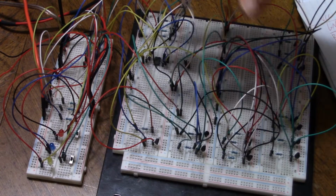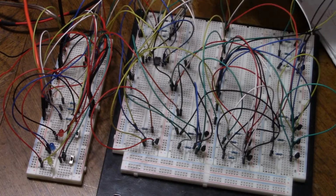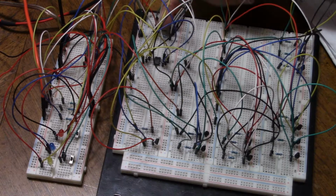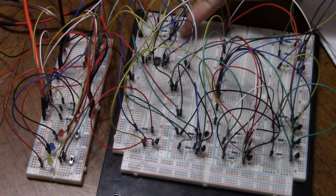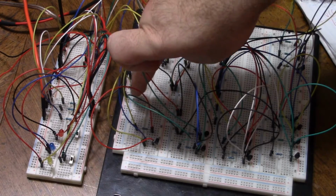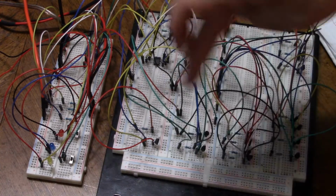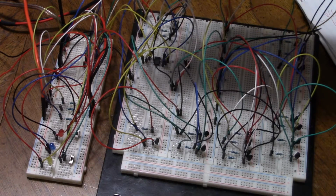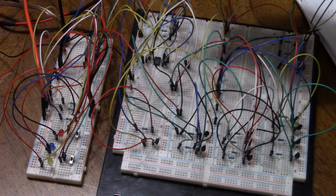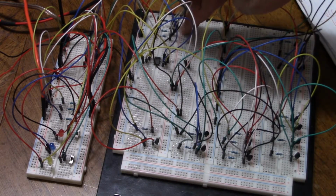Then over here is the actual chip. So VCC and ground come in the corner, and I've got the voltage divider, 3 resistors forming the voltage divider here, and cont is connected to the first one. The 2 of them give the high and low ref, which I have brought over here for organization. This is how I can make boards that look this ridiculous and they work fine because I do it piece by piece and I'm organized. So here's href and lref from the cont pin and the voltage divider.